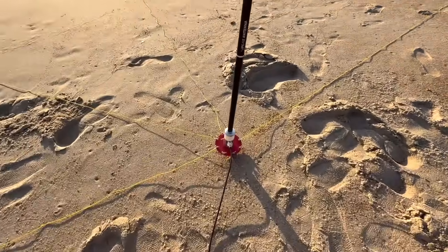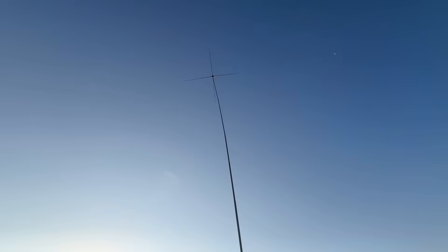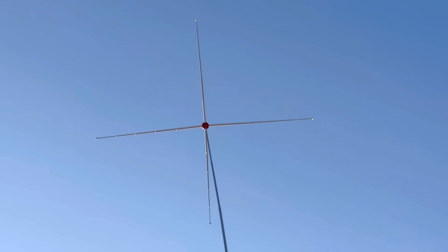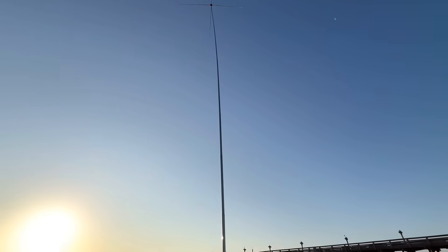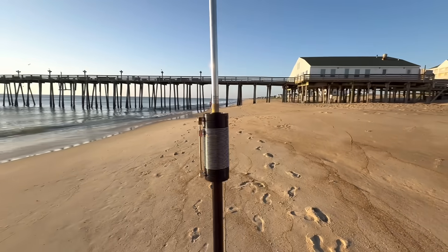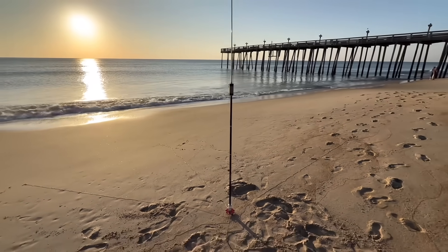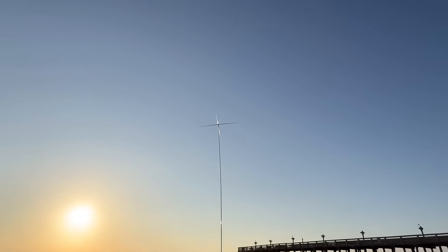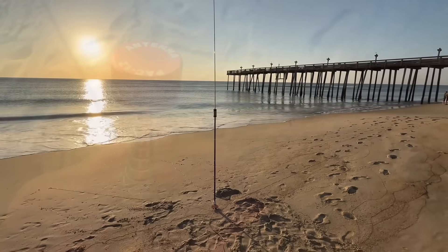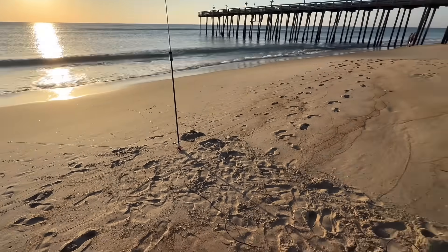As you can see, the base is another mod I've done, so everything down there is all modified and new. There's the coil. And as we look up — fully extended — there's the capacitance hat. I've already tuned it. The normal spot on the coil for 20 meters is a little different; it's up a couple of notches, so it definitely did some shortening. Hey, that's the Kitty Hawk Fishing Pier right there. The install is pretty easy — just one little Allen wrench, you screw it on the top, put the little telescopic whips on it, and extend them out. Here we go, let's try to make some contacts.